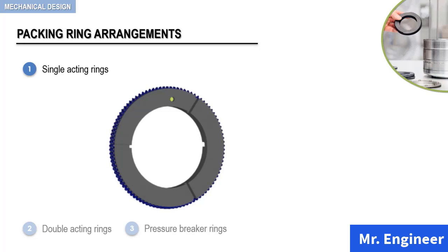Now, we're going to observe this arrangement by making the ring on top alternately opaque and transparent. In this view, the top ring is opaque. Notice that the gap in the radial ring and the cut in the tangential ring should not coincide.